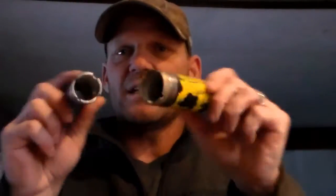You maybe have an eighth of an inch gap on each side of the pipe that you can get away with, but that's about it. So anyway, get some diamond drill bits — they're really handy. All you need is a drill and a little bit of water, and you'll be perfectly fine drilling around those pipes. I'm Joe Diesel, your certified tile setter, giving you your tip of the day.